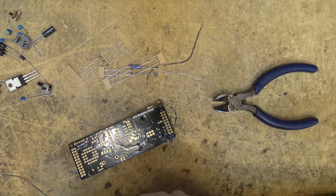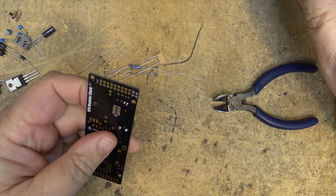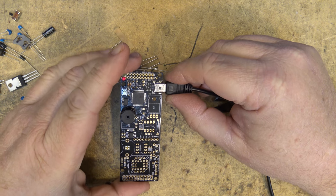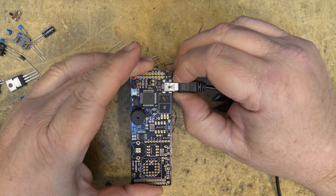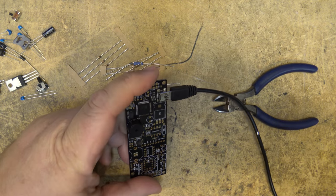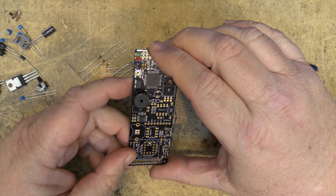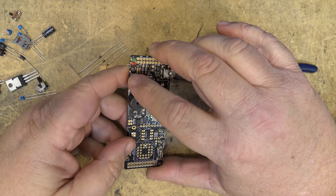Now we're ready for the first test. To test the microcontroller, we plug in the power and we should hear a beep. That tells us the microcontroller is working. Next, I should hear a beep after a few seconds, and then if I press and hold the reset button for a short while, the LED marked 'L' will pulse. After it stops pulsing it will beep again — and there we go, that means it works.